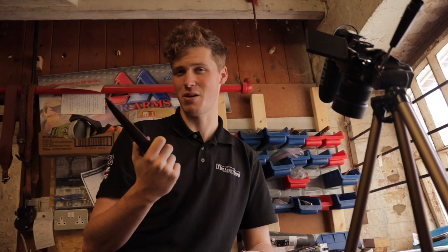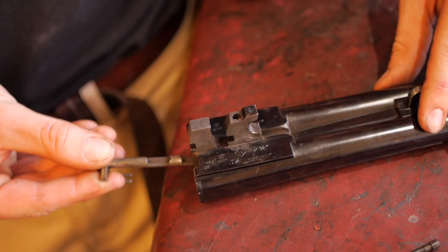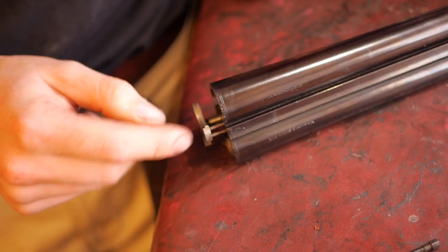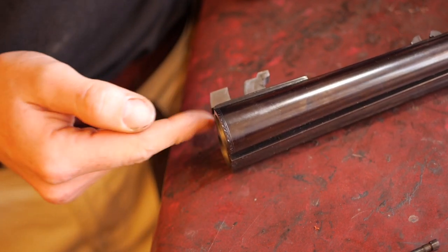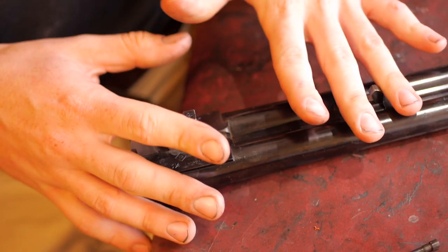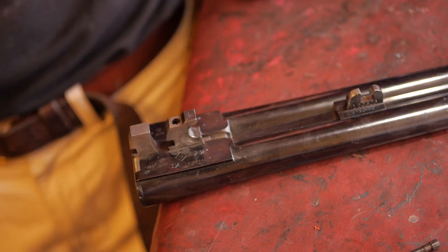Then we'll try to explain how Southgate ejectors work. I always like to put these in together, and as you put them in keep pushing straight. There's a little guide hole at the top — make sure these rods are aligned. Don't put any unnecessary pressure on; they should really just go in lightly. If you start to put pressure on, something's wrong, and if something's wrong the last thing you want to do is just keep shoving.